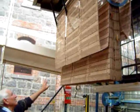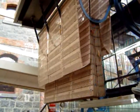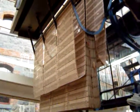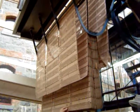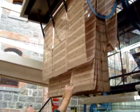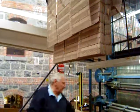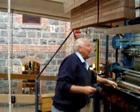Now we'll find out why. All those holes you see throughout my patterning system mean absolutely nothing. Remember up top you saw the three cards go in and out on the jacquard. We know opposite every one of these holes and blanks there's a needle like this. The holes mean nothing because they simply fit over the needles like that. Nothing happens, nothing changes, nothing alters. But where there's a blank, the blank will push the needle out like so, and opposite the needle, guess what? Are our colour pegs.